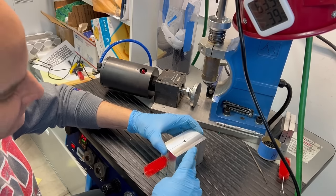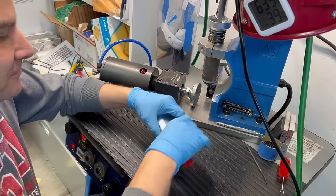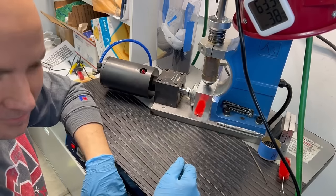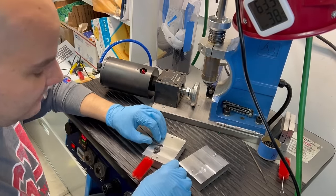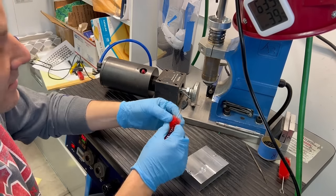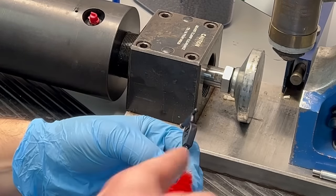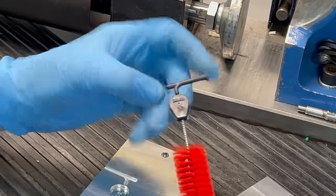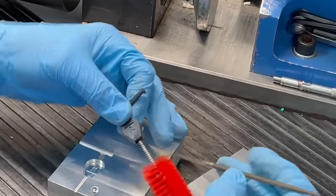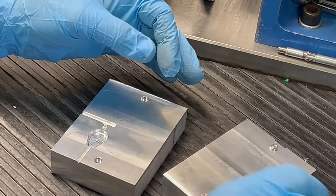I was filming on my iPhone because my regular camera battery died, so we restaged his first reaction once the compressor shut off. Wow — not bad for a first shot. Just sticking it in, it seems to have shut off and clamped down really tight around the wire. We are getting a little bit of material going around the wire, but that's not too bad. There is some flash by the wire — we're probably not clamping down as tight as we could be there. See that? That means you can drop the pressure a little bit.